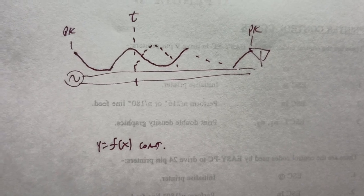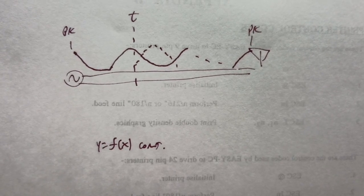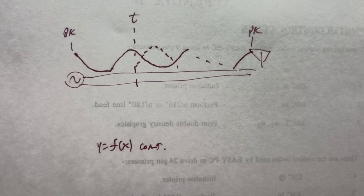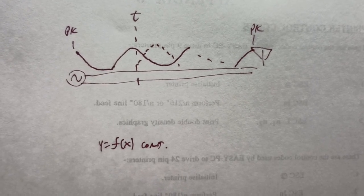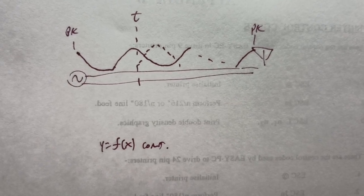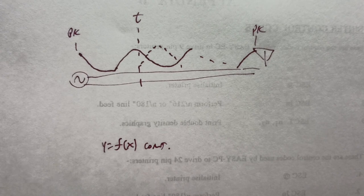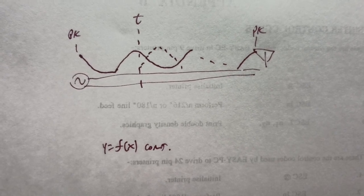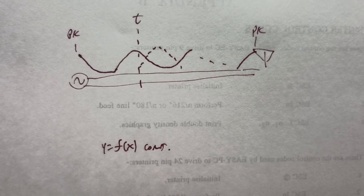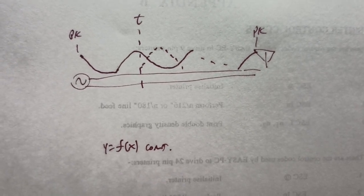And that material slows down the wave propagation. So therefore, the line has to be shortened by a factor of whatever the half-wave or 2 wavelength distance is at the speed of light, multiplied by the velocity factor of the line. You'll get pretty close. The measurement I made on the 15-meter dipole was 0.677. That's dead nuts accurate. The stated value for polyethylene is 0.67.